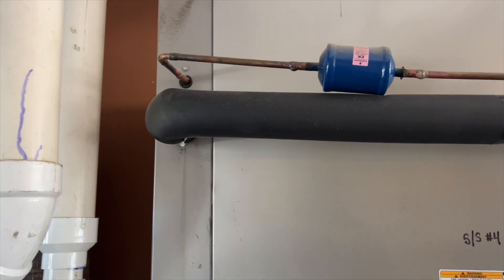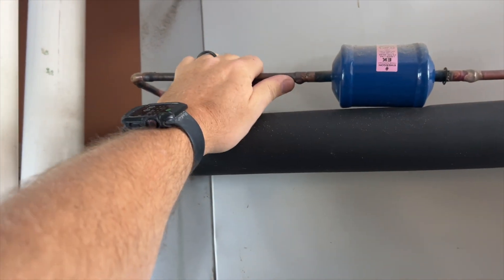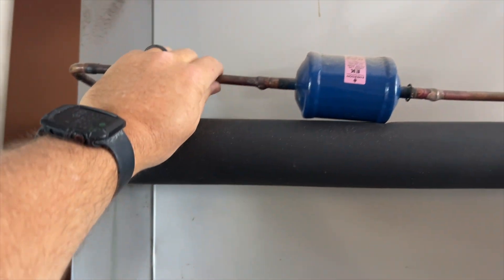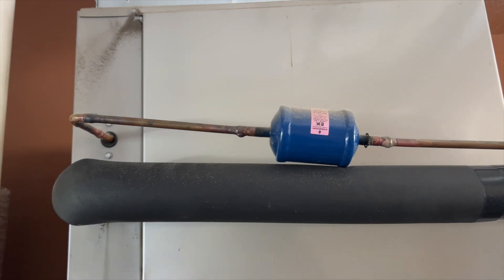We're back in the loft — no cool call, this is red hot, this is lukewarm. The condenser fan motor failed, so let's go on the roof and find the outdoor unit.